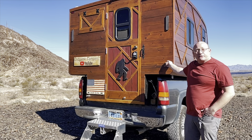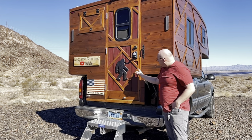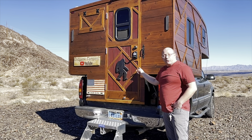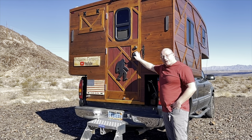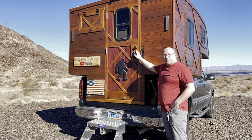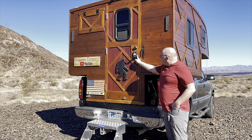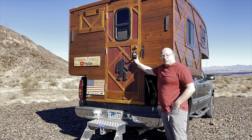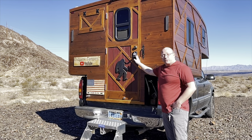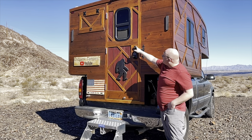This is the back of the camper. This door was completely handmade by myself. The frame structure is oak, which provides extra strength and durability, particularly as it pertains to the lock set. This is a residential lock set, very much like you'd find in your house. I use a combination keypad, which is convenient when you don't want to carry keys or when you're going in and out frequently. I also have a deadbolt that's keyed on both sides.